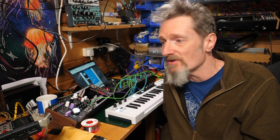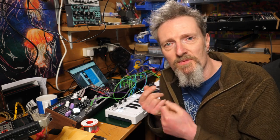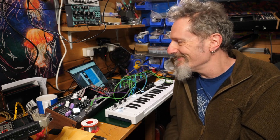The thing I had with the voltage earlier, I gave Axis Modular a shout and they said it should be all right. There could be a short. It should be 12 ideally, but 9.5 will work well. If you're having problems, then go through and do a bit of resoldering, which I might well do. That means taking the front panel off, which is a bit of a pain. But I might do that and have a look to see whether I've bridged something somewhere or something's not quite soldered in as well as it should be. But it seems to work fine. So from a troubleshooting point of view, it seems to be very forgiving, I would say.